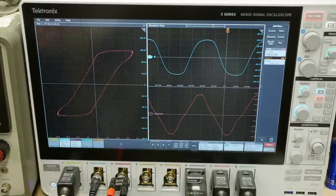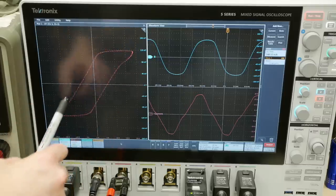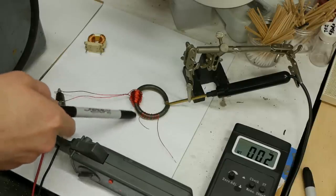An important thing to keep in mind: this whole system is dominated by the air gap. The reluctance of the air gap is much higher than the reluctance of the material itself. If we wanted to measure the material without the influence of the air gap, we'd need another scheme — using the air gap to insert our Tesla meter affects the whole system. What we're actually measuring is the saturation of the whole system including the air gap. Steel actually saturates much higher than 120 millitesla; it only shows up this way on our graph because of that air gap.